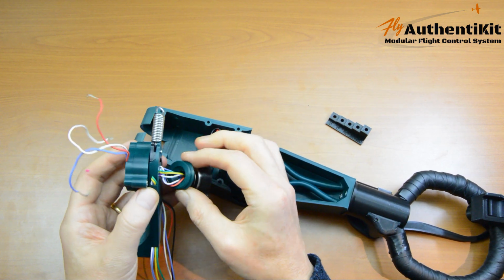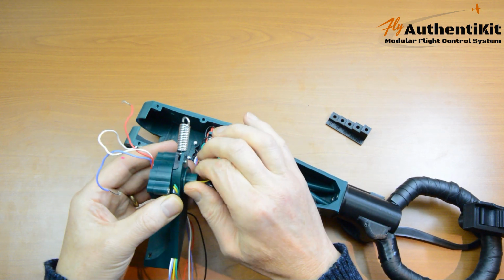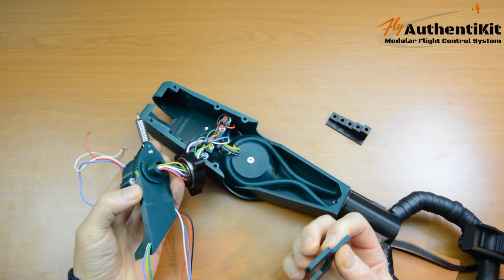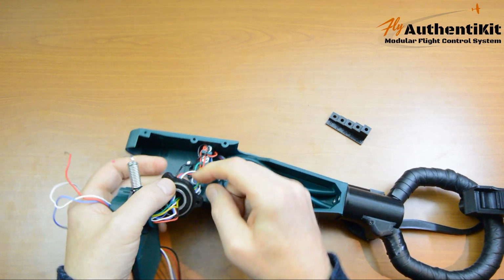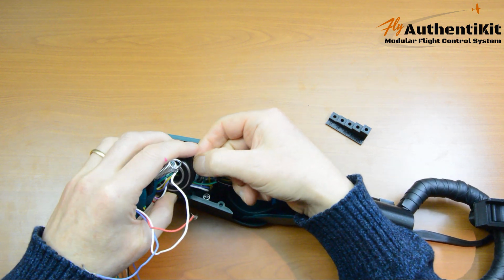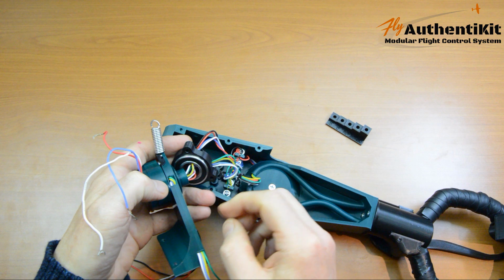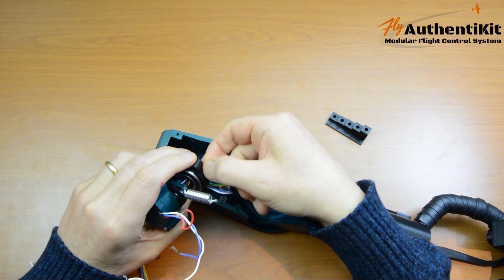Now it's time to pull that pitch peg up towards the thread, and now we can tighten up this pitch peg with our pitch peg lever. Okay, now we can slide the bearing back to the pitch peg. This takes a little bit of time. You just have to do this carefully because there's a bit of friction in the slots here, but it will slide back. It's taking a little bit of time, folks, and actually I said I was going to redesign this and make that cavity wider. I'm actually going to modify the design of this so there's a bit less friction for sliding these wires back.